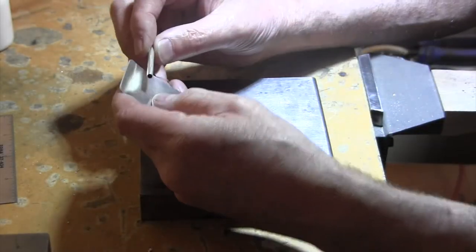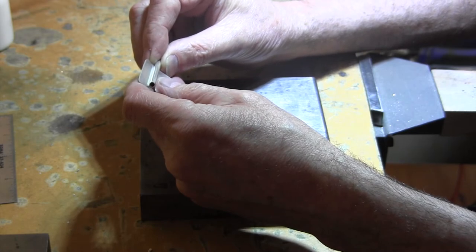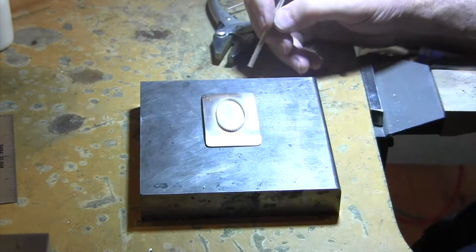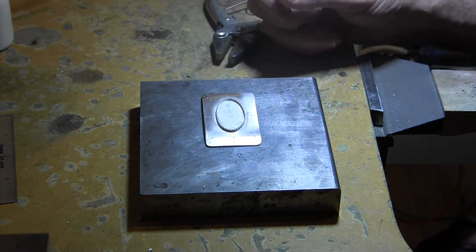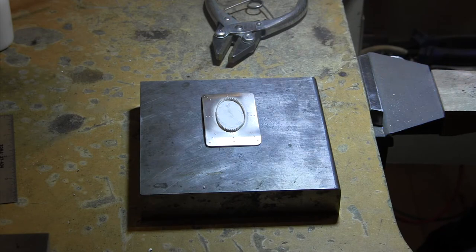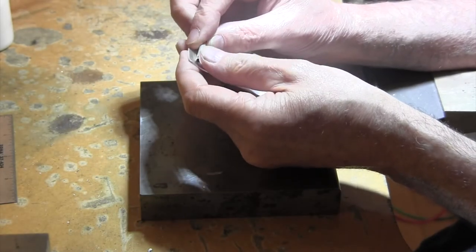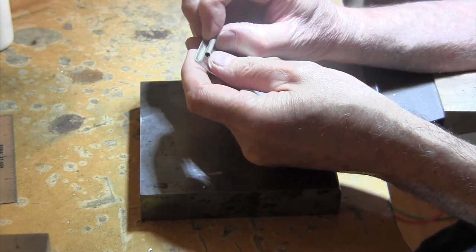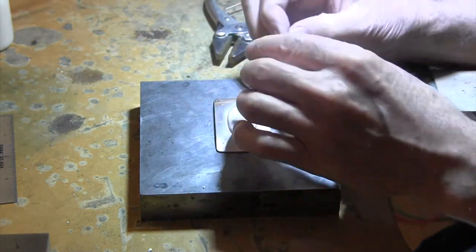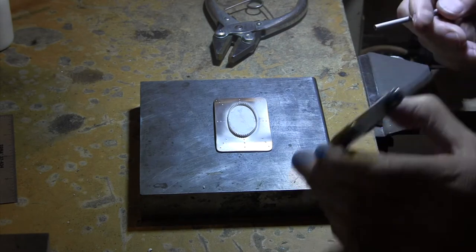Now, the next step is I want to put on a tube on the bottom of this. And so this is going to be for about a 1-inch belt. Couldn't be smaller. It won't be able to be larger than that. So I'm going to make a tubing that is about 7/8, something like that, inches long. And we'll do that with our miter jig right here.